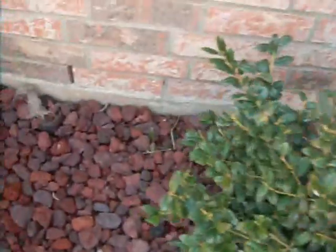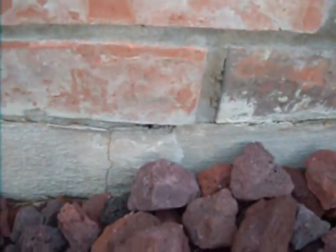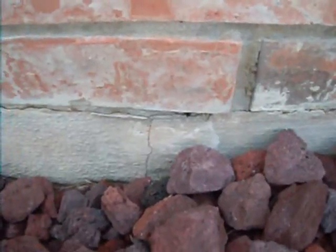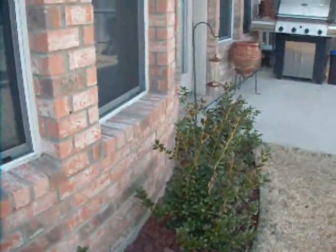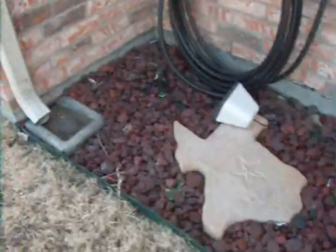Now, to give you an idea of what parging is, this area here on the foundation's been parged, and you've got a crack appearing in it. It could actually be in the foundation as well, not likely, but cracks in foundations are common. They occur shortly after the foundation's been laid. There's another one here, but I think it's the parge that's showing the cracking. But if you were to parge this whole area along here, because you'll have enough waterproof cement to do it when you buy it from the Home Depot, that would cover it up. Look good.